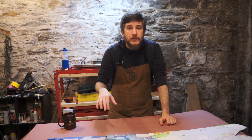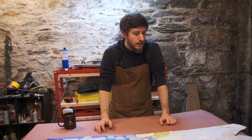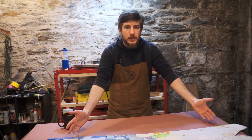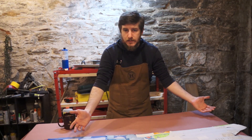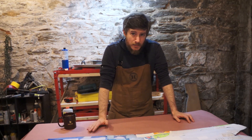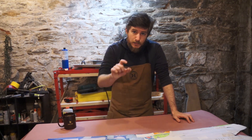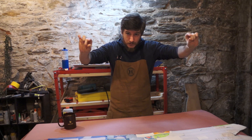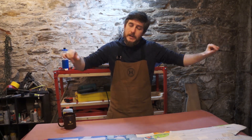The plywood I'm using as my veneers in these layups is eighth-inch. When you get out into the nose and tail of the board, you've got three sheets — three-eighths of an inch of wood that's just weight that doesn't need to be there. Every professionally made snowboard or ski has a profiled core, meaning it's thicker in the middle and thins out as you get towards the nose and tail.